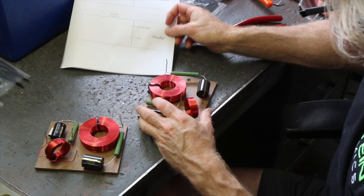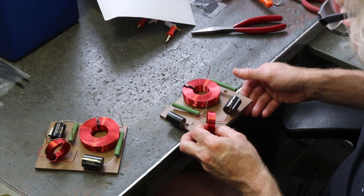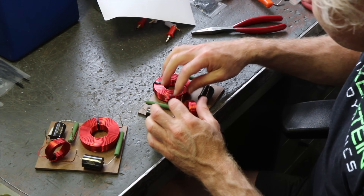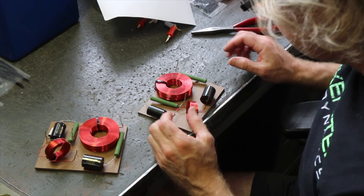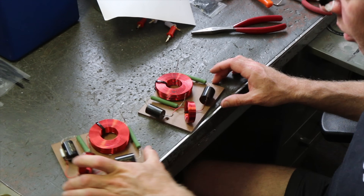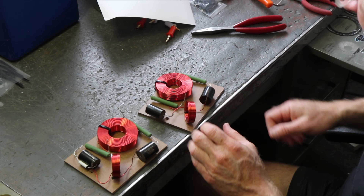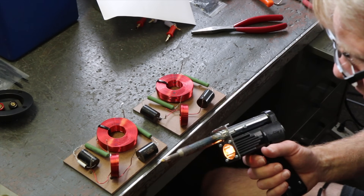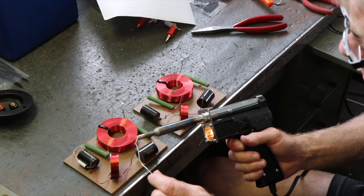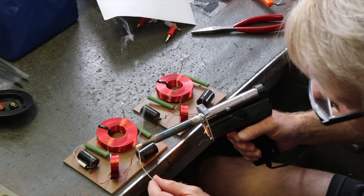So now you've just watched me assemble one entire crossover, just like that one there — we spent maybe three or four minutes. That's the whole thing. Next I'm going to solder all of it together so it doesn't move, then place it squarely on the boards, mark all the spots, drill holes in the board for the zip ties, and zip everything down. Next it's time to do some soldering. We always want to make sure the soldering tip is clean, get it good and hot, and put some solder on the tip — always want solder on the tip.